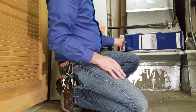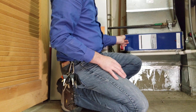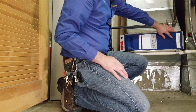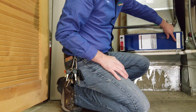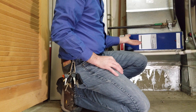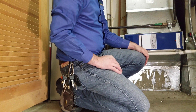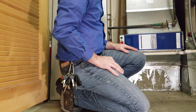Either way, you should know that there is one direction of airflow, and usually what you want to do before you work on it is turn it off at this button, which may look different on yours. If the light is off, there is no power. One way to test if there is power is to turn the button on and use this test button — if you hear a spark, everything is functional. If you don't hear a spark, the coils may be wet, there may be debris around the edges shorting the coil to the casing, or there may be debris between the fins of the cleaning cell.